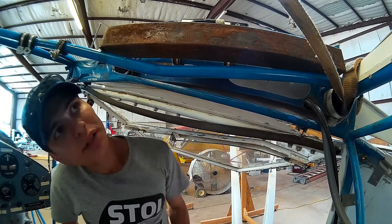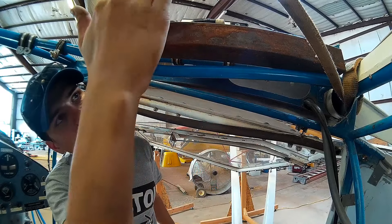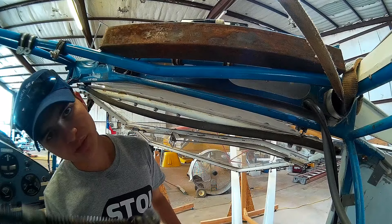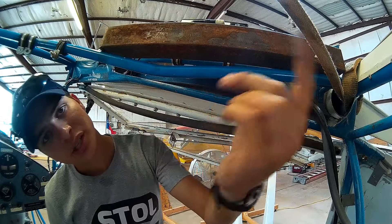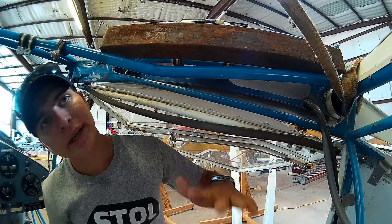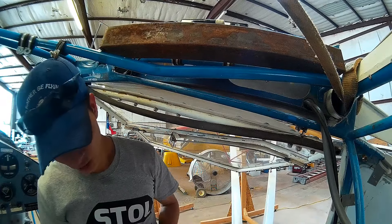What I'm doing now is I've got this tube here that needs to get straightened. I'm going to put this steel bar up here, grab this big fat C-clamp, and clamp it on there and squeeze. As I tighten that — you might not be able to see it, but there's a strap here — as I tighten that and try to straighten this, it should straighten a good portion of the spring.